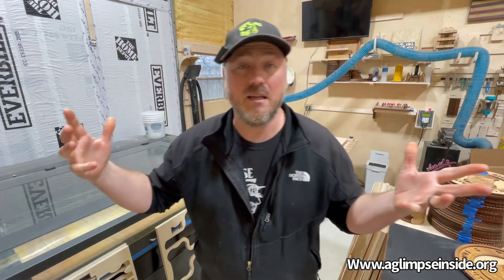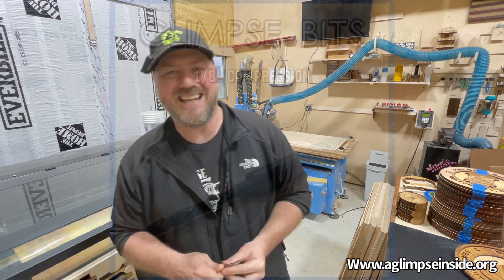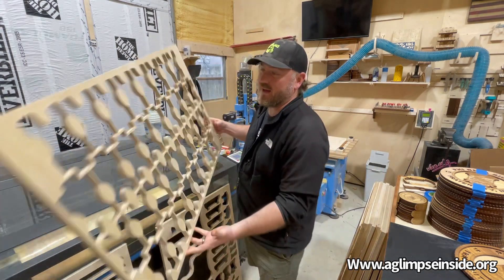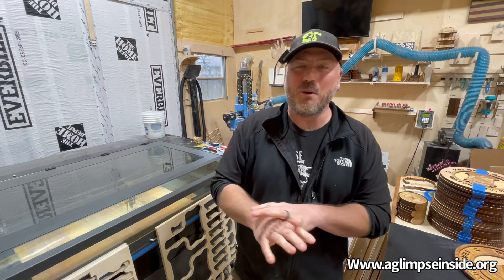I got connected through events, especially at IWF, with the CEO and owner of Southeast Tool Company. He said they're an industrial company — they manufacture massive bits and have big customers all over the country, supplying industrial machines with router bits, not in the hobbyist market at all. We started talking more and more, and he said, 'Let's try to develop something.' So we developed an eighth-of-an-inch compression bit, about an inch long. At first he was just making it out of high-quality carbide, and I was getting about four to five sheets cut without much degradation — and that was without any coatings whatsoever.